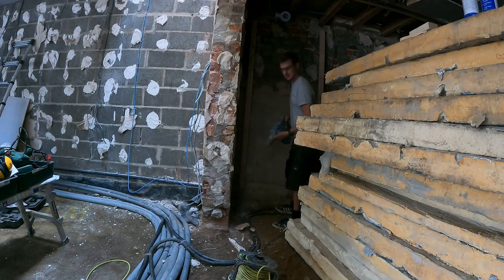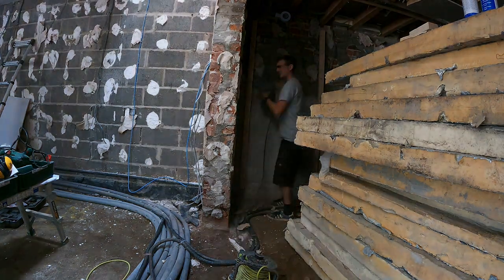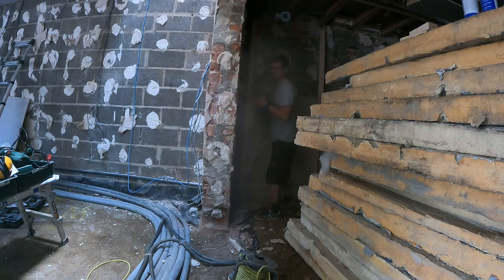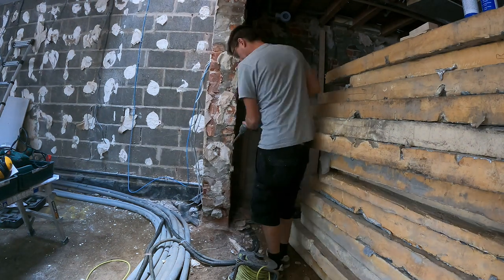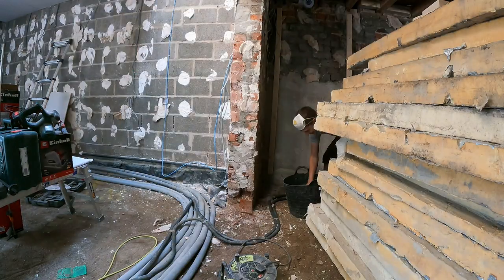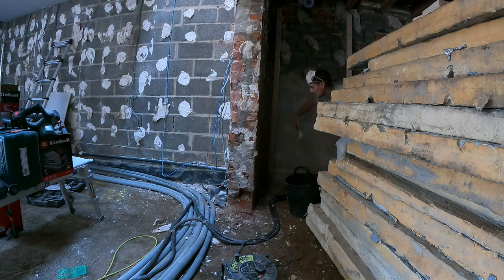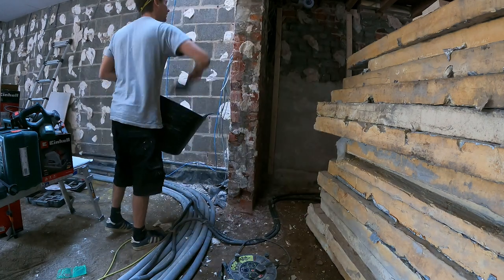Back by popular demand, another quick voiceover video to explain how I managed to deal with the tanking within the house. Before you tank, you just need to remove all excess rubble and other mortar to make it smooth before applying the tanking slurry. Then you just need to go around and give a little bit of dampening to the brickwork, to give a bit of moisture for the tanking slurry to stick onto whilst applying onto the wall.